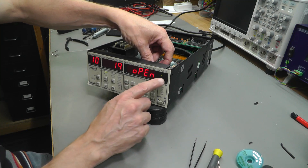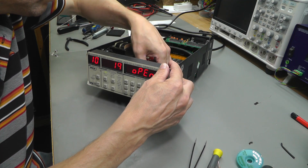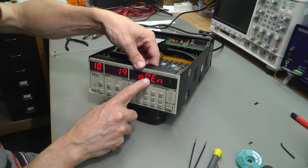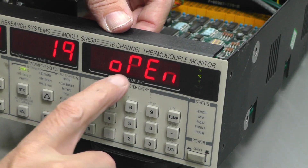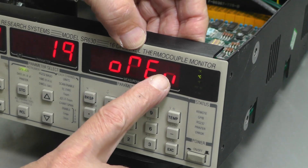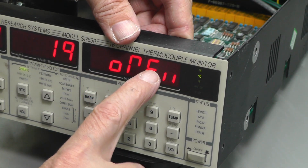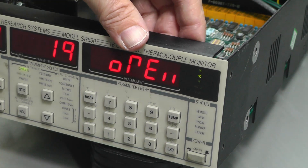I presume the issue is on the display board because it wasn't like a whole row was out. It seems alright now — wow. I think I will take off that display board. There's a flickering one beginning to go. Zooming in — you can just see those two there starting to flicker. I hope it's not the LEDs, although with a unit this age it's probably an off-the-shelf LED. If it's not a dry joint, it's probably on the actual segments themselves, since this one is okay, so the row drive for the row scan — I think I'll take off the display board and take a look.